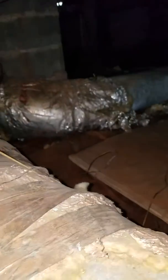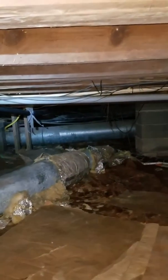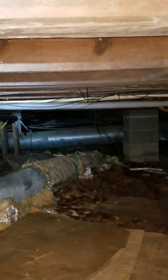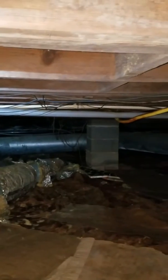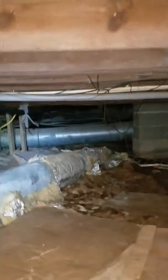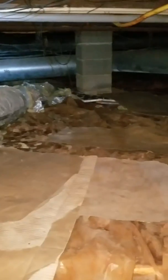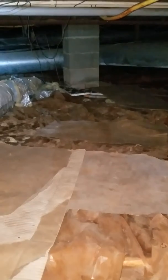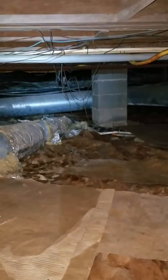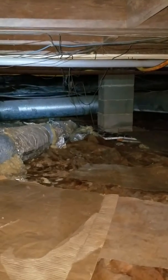And, you know, I'm glad I came under here to see. Now, this collapsed supply right here, I suspect is going to the other wall over there, to the master. Yeah, that's going to be a challenge a little bit. I guess it can push through. We just have to move some of that stuff out of the way. Or we could put a flex line at the end of that. I hear that if you put 10 feet of flex at the end of a rigid, it's okay.